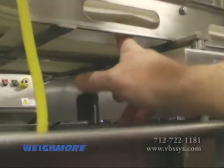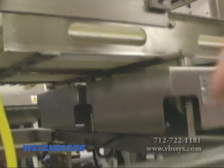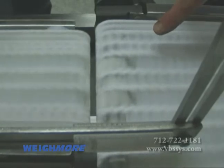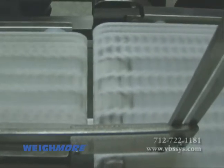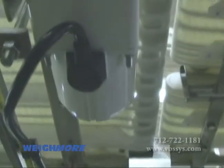The conveyor is designed with gaps on each side of the belts, and belts have an open design so that any debris that accumulates can be easily sprayed out. This open design allows for sprockets to be inspected or cleaned through the belts. The motors are usually NEMA 4X in type.